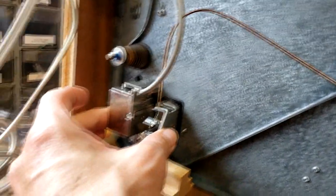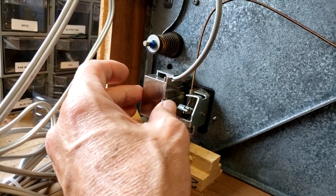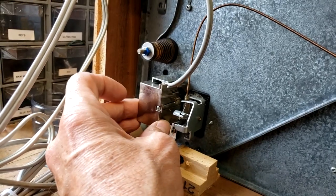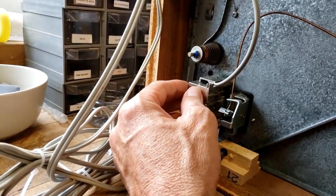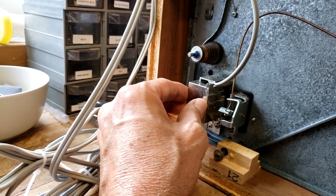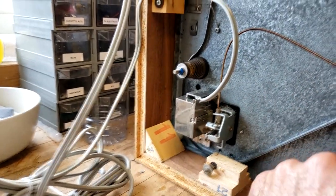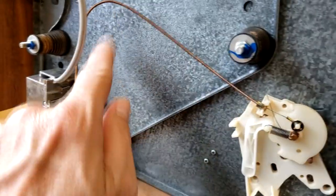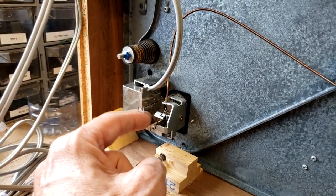So just looking at the bottom here, you can see where the tone arm assembly comes down, and this is interesting. Yeah, I had not seen these boxes. I've only worked on 165s prior to this one, but you can see the block assembly arrangement from a TD-165 is considerably different. So it looks like I have some disassembly to do here, and then of course we have to disconnect the tone arm lifter assembly, which is a cable that runs here, and what I'll end up doing eventually is taking off the old silicone grease.